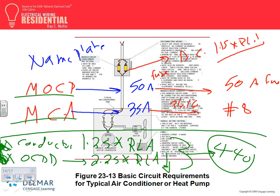So for AC units, all you have to do, guys, power-wise, is provide a disconnect and a fuse, and power the equipment. How about the control? The control that comes with it, the thermostat, you bring two wires from here. I'm going to use which color? Black. So from my controller, somewhere here, you bring it all the way to my thermostat, and that will be my two number 16 wires. That's going to control the thermostat that controls the AC.